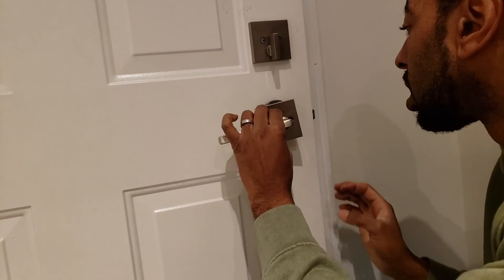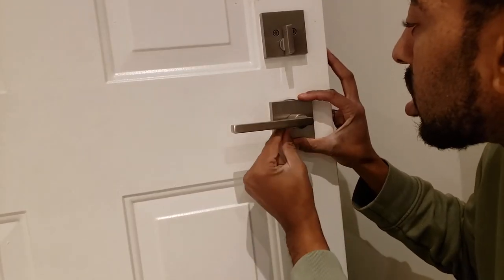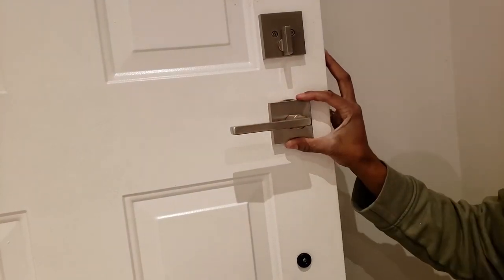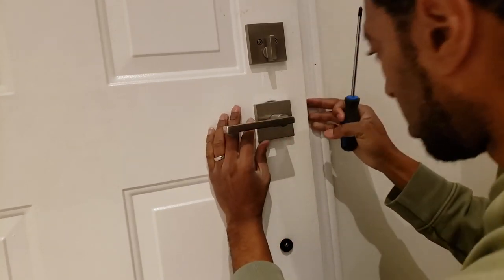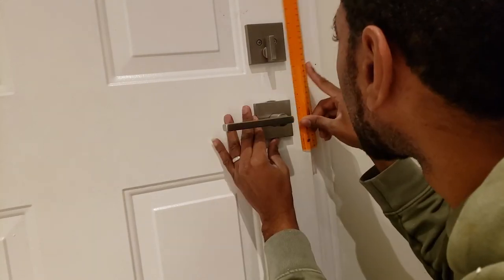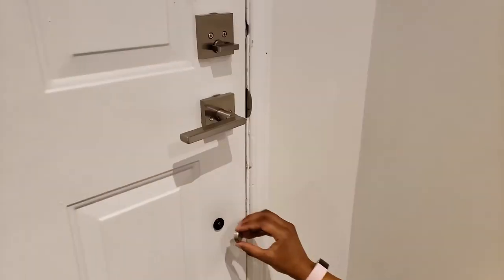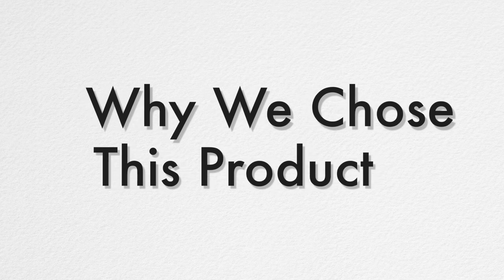We're going to buy a new door soon anyway, so that's why I didn't bother. We are almost done — all we have to do now is put on the inside handset and the little cover that goes over the bolt at the bottom. When putting on the handset, I put both bolts in but tightened one not all the way — just enough to stay but still rotate, so I can ensure it lines up with the piece above it. Use a ruler to measure. Once everything lines up, tighten all the screws. There's a cap that goes over the screw at the bottom so you don't see the screw head from the inside. Then tighten up all your striker plates and that's it.